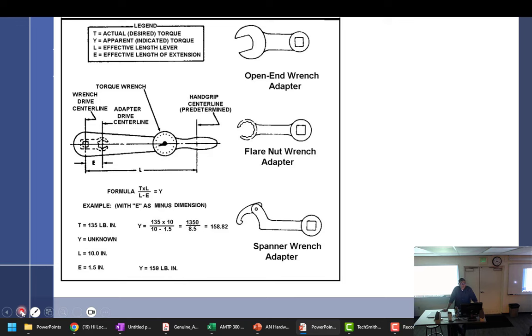Engines aren't quite that bad. But sometimes it'll be in the wording. They'll be talking about it: now, assemble the connecting rods to the crankshaft, using a wet torque for such and such, torque each one to 480 inch-pounds. Sometimes you'll have to go to a torque chart. It'll say, torque the connecting rod bolts. To what? You have to go to the back of the book to the torque section. It'll say, connecting rod bolts for this style engine, that. And then sometimes you'll get there and there's nothing.